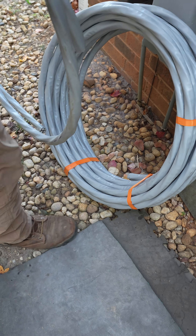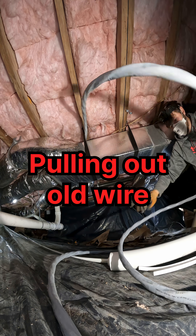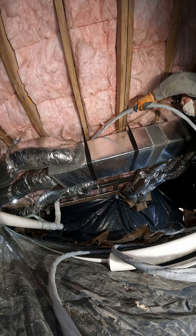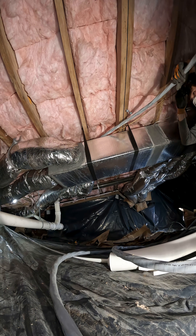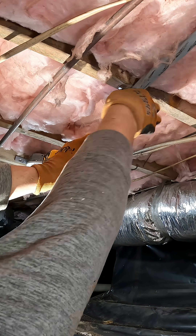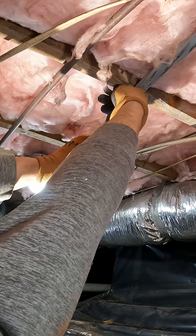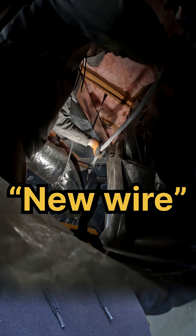When I called the electrician because I was worried, I said, 'Can I run 125?' He said yes — they give you an allowance to size the wire up a gauge. So technically I am covered with this 1/0, but I thought, everything's open, why not just pull another wire? My only concern was switching to 2/0 wire. He said it should fit — typically it fits.